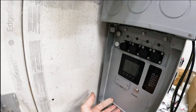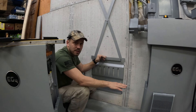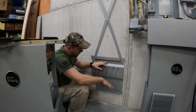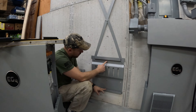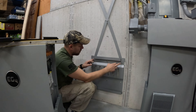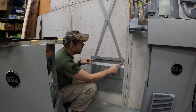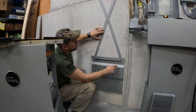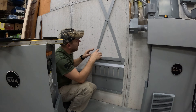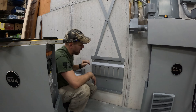Also, there are these nifty little handles down here that make it easier to lift if you have the cover out. In order for these batteries to sit on the ground and have this bracket work, we're at 25 and a half inches. I just put one long screw here because I'm not too concerned about it having to hold all the weight. I put these in because I believe the only purpose of these is to help you line up and get the right height when you mount the inverter on top. They don't have any structural strength — they're super flimsy — so I think they're just there to help you line up the inverter.